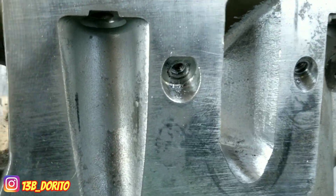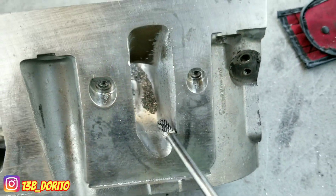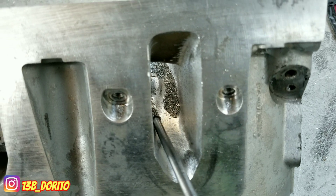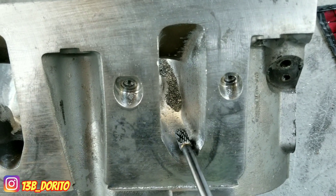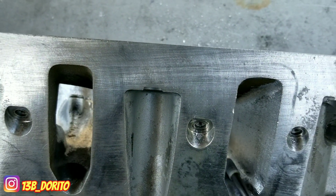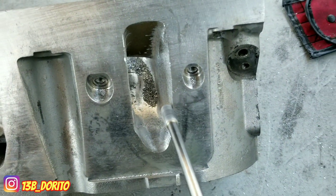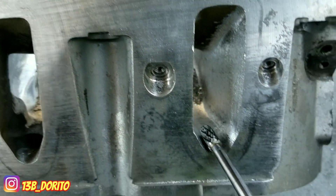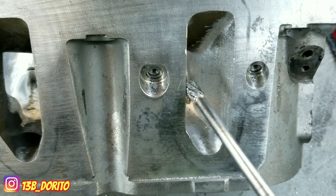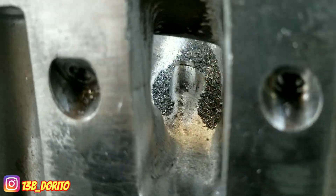When you are working on aluminum, the way you are going to make your way out is this way: don't stay for a solid 3 or 4 seconds in one spot. You go here and go side by side — side by side on this one. You go side, side, side, work your way out. If not, you are going to make a groove on it. Try to go side by side — that is going to be the only way to get experience. But anybody can get it done, all you need is the tools and take your time.